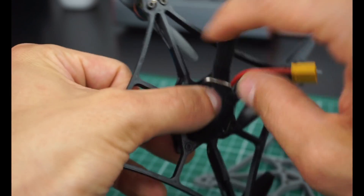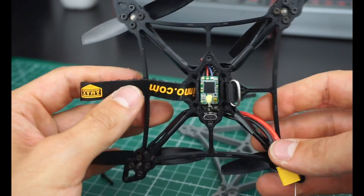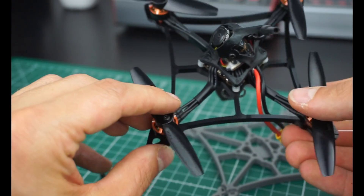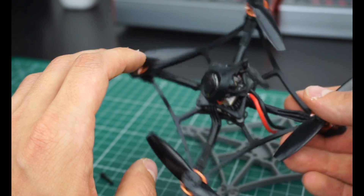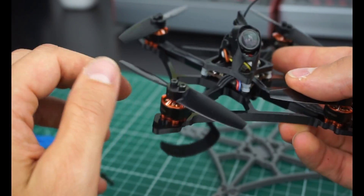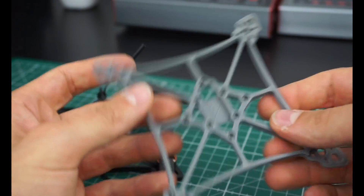Another thing I can show you on this finished build — I've included this little platform here, and I did this for a reason. It's specifically designed to fit a FrSky or Crossfire Nano receiver. This is a FrSky XM. In these tiny canopies there isn't a lot of room, so it's easier if you just have to get the VTX in here and you have a nice spot to mount your receiver. You can get the wires to pass into the board cleanly, so it's all super clean.